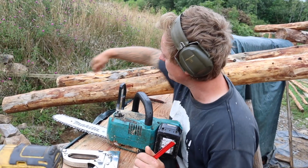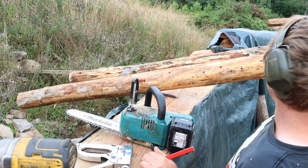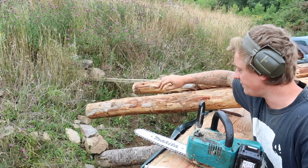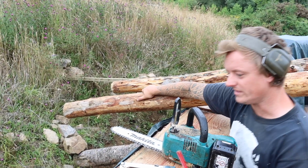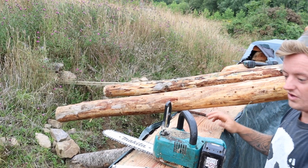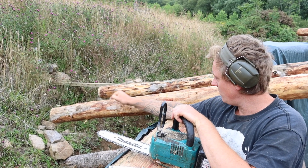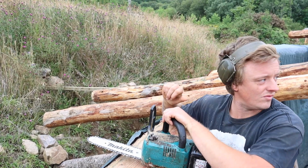So every meter we go out that way, we can come at least a meter back this way before we're even adding any weight to that beam in the middle, and that's why the overhangs add a significant amount of work, because it's extra roofing, extra turf, extra materials, but they deduct the weight on the things that are holding them, massively so, and apply it to the wall instead. That's another very good reason for long overhangs. Mostly the reason is for weather, to keep the weather off the earth bags, but because that really big overhang has a lot of weight, it counterlevers the weight off of that frame in the middle.